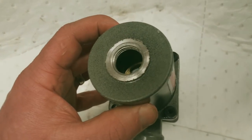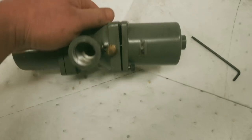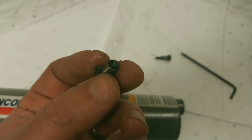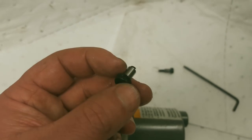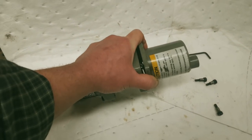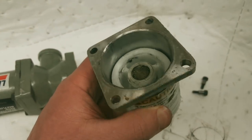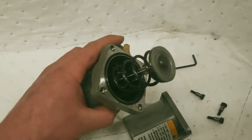Let's have a look-see. I've never had one of these apart, but clearly there is some spring of a thing in there. Rookie mistake - lefty loosey, righty tighty. The thing is pretty anemic; I think it's not user-serviceable parts inside. I'm holding it with my fingers so it can't be all that skookum. In here it looks to be UHMW or Delrin - probably Delrin - on account of the anodized aluminum piston, probably with an o-ring in there, and here is the return spring.